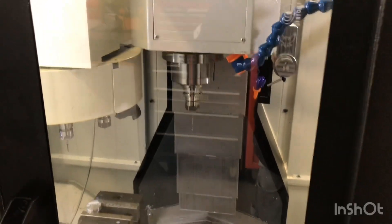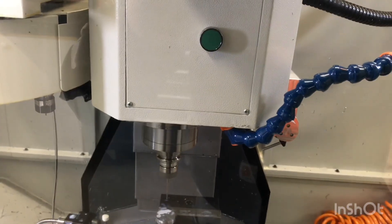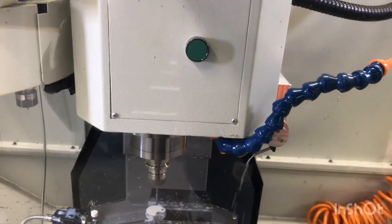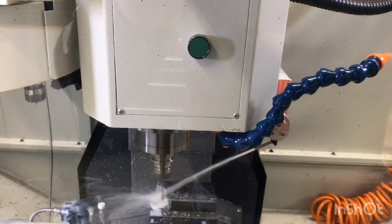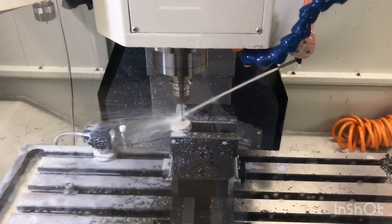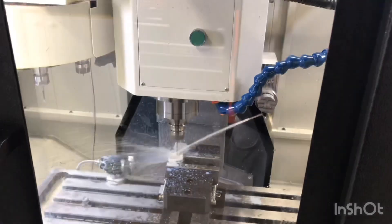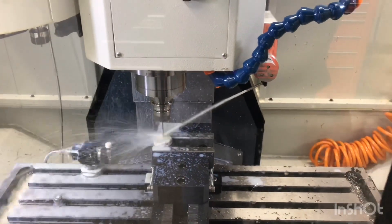I got the feed rate backed off here because I'm a little nervous. So it picked tool 3 — I believe the nozzle is updated to a good spot. I'm just gonna slow it down because I'm just concerned about my offsets, but I think everything looks good. So that was roughly where I had set the nozzle to — let's see how this goes.